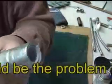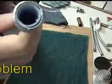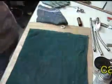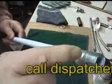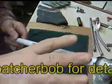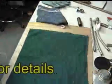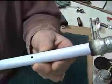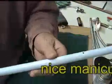What they'll do is solder an adapter on here. The heat of the solder will wreck this dip tube — it will fall off. What that creates is a lack of hot water, or a shortage of hot water. If this dip tube breaks off, it'll create a shortage of hot water.